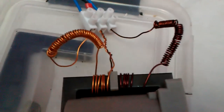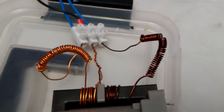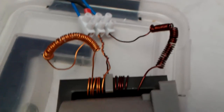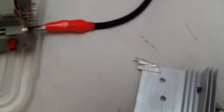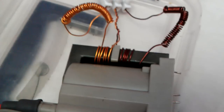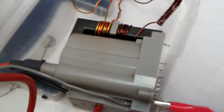I have been messing around with this for around about ten minutes, trying different arcs, taking down the windings. I'm going to take down the windings a little bit more actually, because the less windings you have, it changes the input on the flyback. And with more windings, you've got to experiment to try different windings on the flyback to get different outputs. It varies on the flybacks you're using as well.